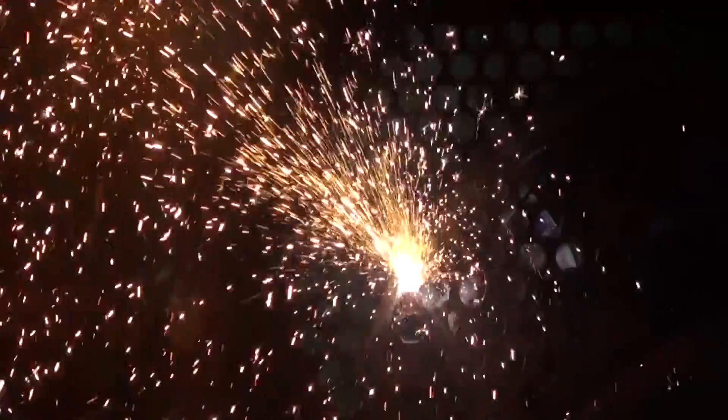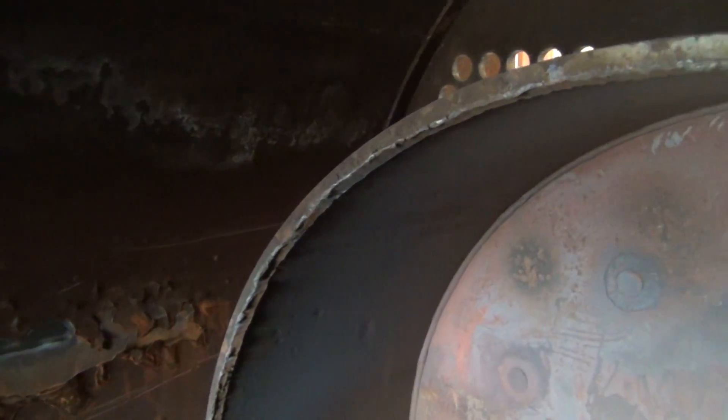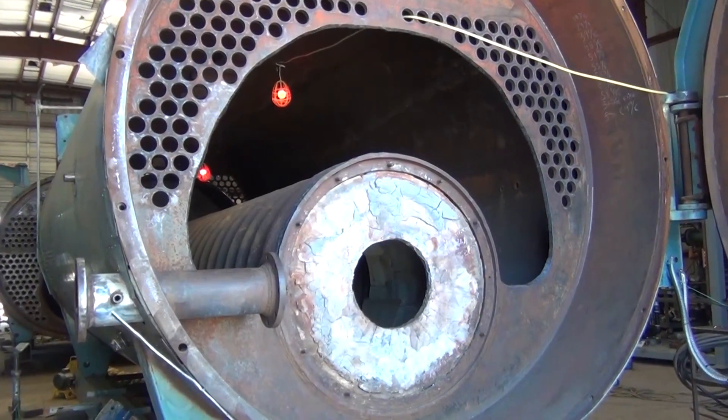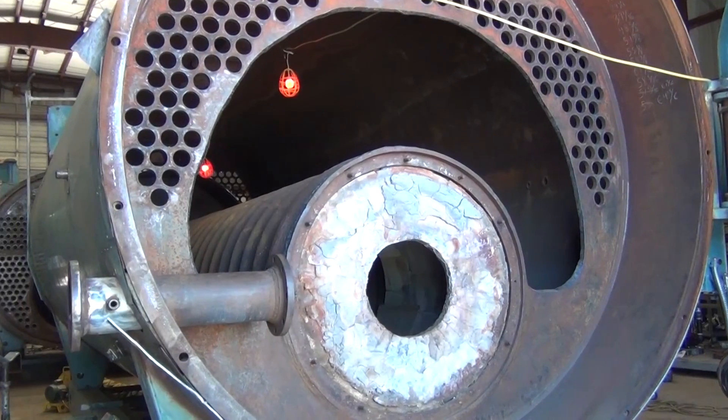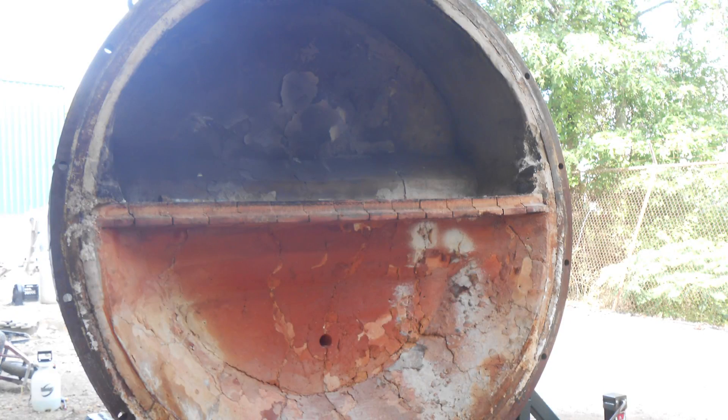The vessel and tube sheets are made of a material much thicker and generally are not greatly affected by the expansion and contraction occurring through high and low temperature changes. That is not always the case, however. Lack of proper maintenance and oftentimes operators that are improperly trained on boiler starting and operating procedures can lead to a boiler with failed tube sheets and even vessel problems.